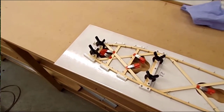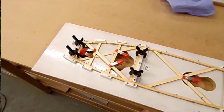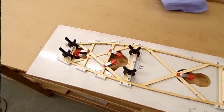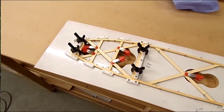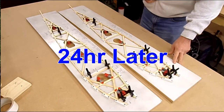So there's enough work time with the resin to do another 10 minutes or so on a half rib. It's a 45 minute work time, but I don't like doing it more than 30 minutes. The resin starts getting a little bit thick and starts to cure a little bit, so I don't want to go more than that. So two batches of resin for me means I can make up two full ribs and two half ribs. Okay, so let's see how we get on.